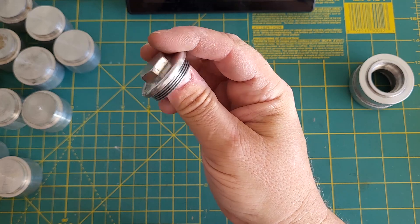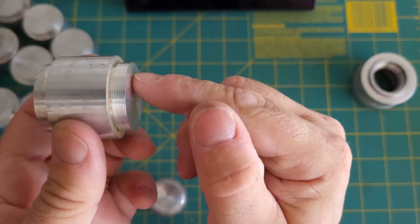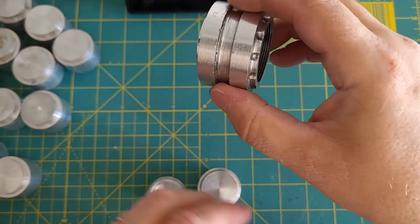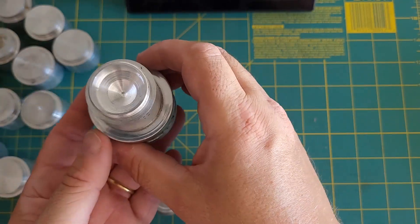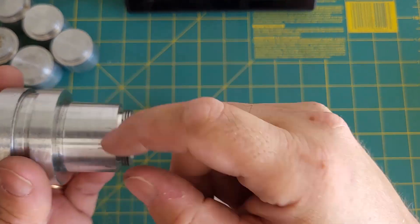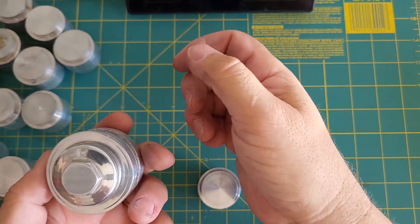I had the lathe so I thought I'd try making some. They were very tedious to make the way I was doing them. The original process was I'd make these billets and cut the thread major diameter and thread relief, and then thread — which on my lathe means hand cranking the spindle, very tedious. I'd then take this and have this jig here as a thread gauge, thread these onto it and mount that in the rotary table. Cut the inside using a quarter inch round nose end mill, put it back in the lathe to cut off and profile, then back in the rotary table to cut the hex. Took a very long time.